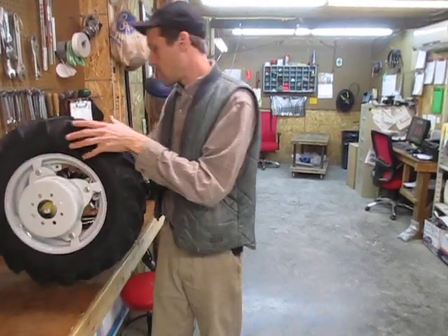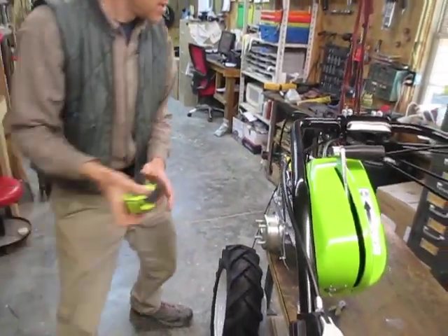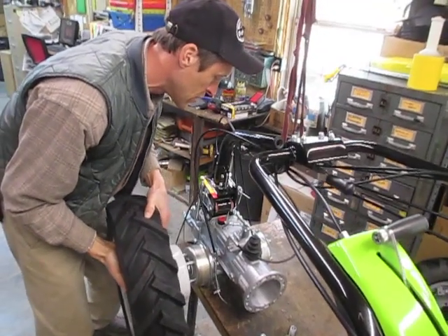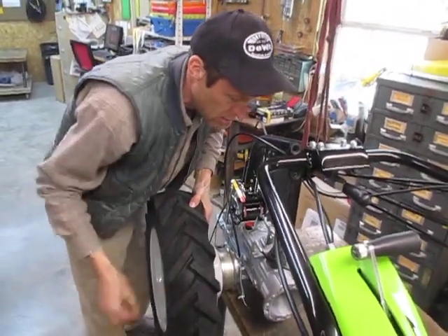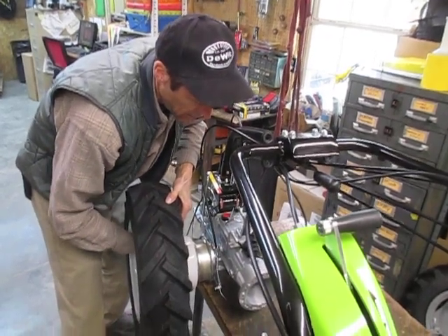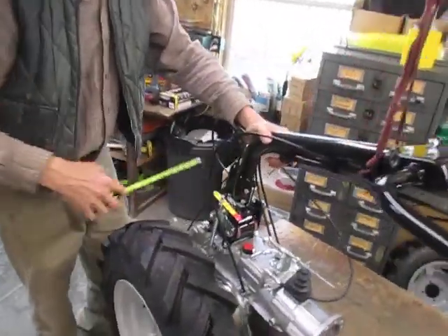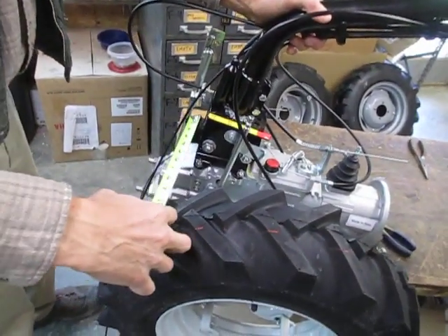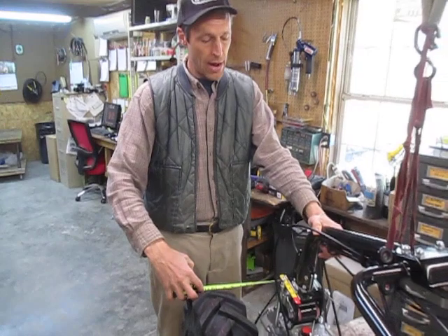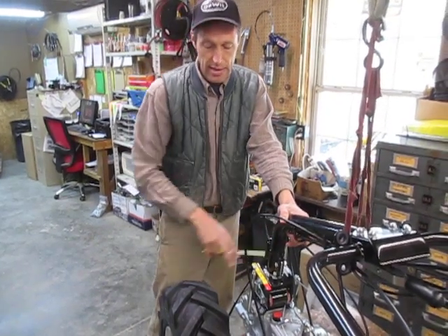If you're playing around with these things and want to determine what your track width is going to be, grab a tape measure. What you do is slap the wheel on there temporarily — you can even do this without tightening all the bolts fully, just two nuts and bolts to hold the hub and rim together to get a general feel. Spin one of the lug nuts on, then simply measure from a center point on the tractor. I'll go to the tow hitch of the tractor, because that's always right in the center on the back. I measure from the center of the tow hitch out to the inside of the wheel. I've got eight and a half inches right to the inside edge of the wheel right now, and you just double that — so that tells me this is going to have 17 inches from the inside of one wheel to the inside of the other.